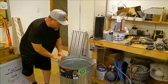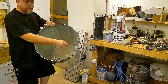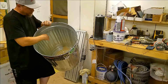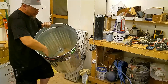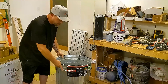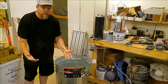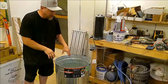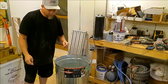So what you've got to do: we're going to take a double piece of plywood in a circle with some holes drilled out, and we'll push that down close to the center. That will keep it from sucking the sides in, because otherwise it's not going to keep the suction or keep all your dust in the can — it's going to end up in your filter.